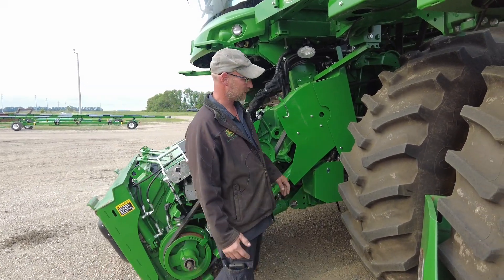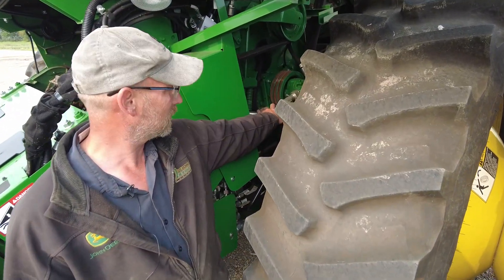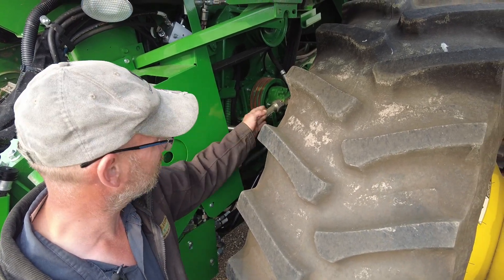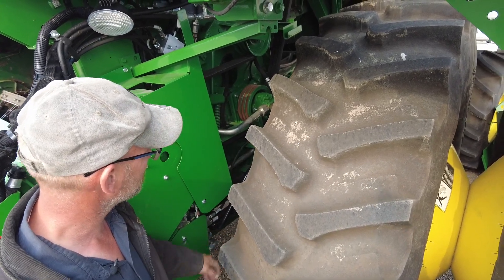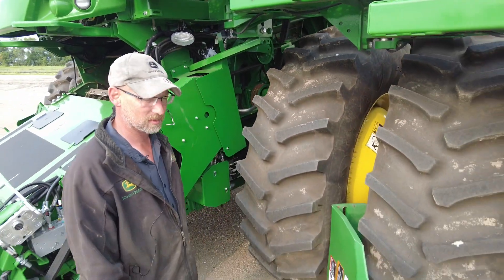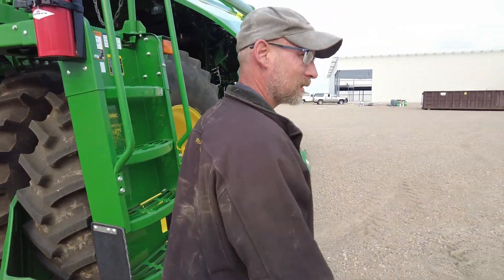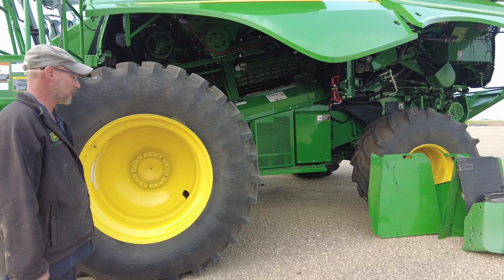Come along to the inside and check our reel pump. If you grab hold of this pipe you can just kind of pull on it — that'll give you a good indication if you've got a problem with a bearing. Look at your belts and also stick a bar in; there's an accelerator bearing inside of here. You want to take a bar and look at that. We're seeing quite a few accelerator bearings starting to have problems as machines are getting some age on them.